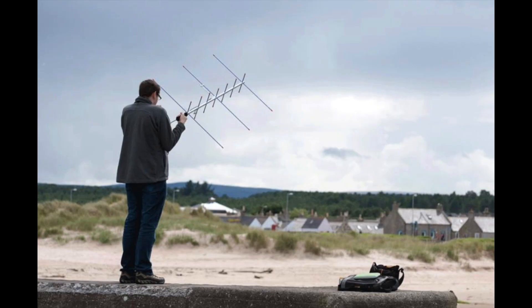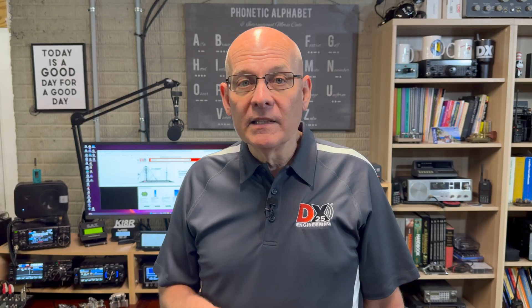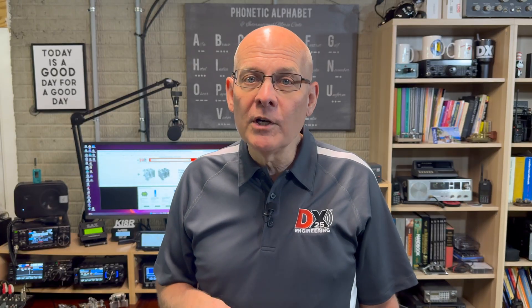The most popular mode on ham radio satellites today is FM. Many of the LEO satellites operate as FM repeaters and often require a CTCSS tone for access. They're usually either 2 meters up and 440 down, or vice versa, and are easy to access with dual-band handhelds and a small dual-band Yagi antenna. Another kind of satellite is referred to as a linear transponder. These satellites work over a range of frequencies instead of just one fixed frequency. They receive a wide bandwidth, say 20 to 100 kHz, for modes like sideband and CW, allowing for simultaneous contacts. These are typically inverting, meaning that you transmit on one sideband, often lower sideband, and receive on the other.